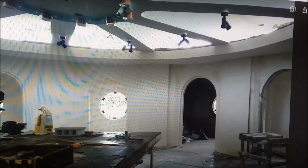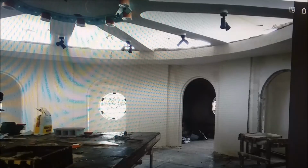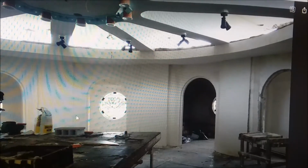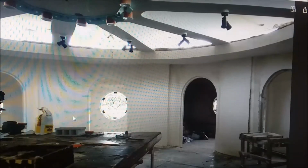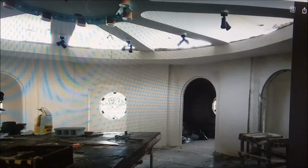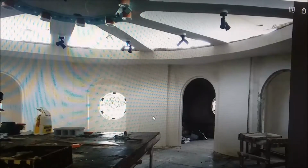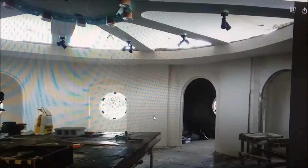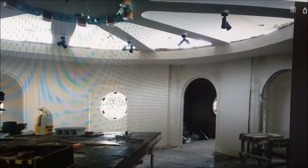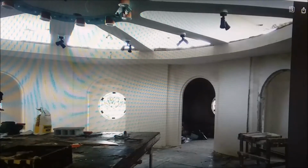Okay. What we're looking at now is the rooms that are not a room. This is above the living space of the house. There's this sort of a zigzag or a spline-shaped wall that runs around here. And that just makes this pretty much totally earthquake-proof because there's so much rebar in it. And the concrete is plenty thick, 7 inches. And then it's got this spider beam up here in the ceiling, and the fan flanges up here.